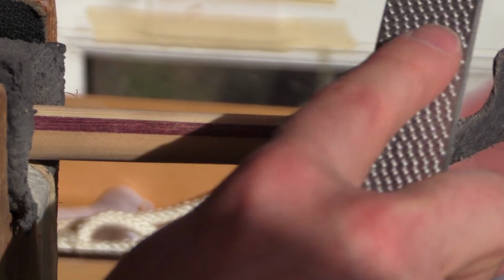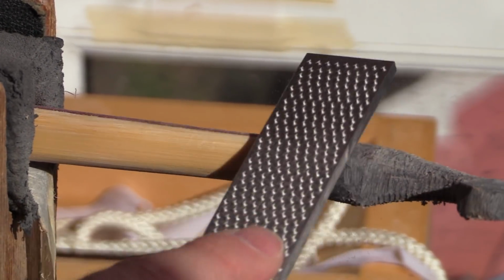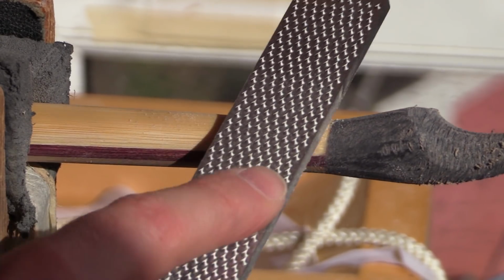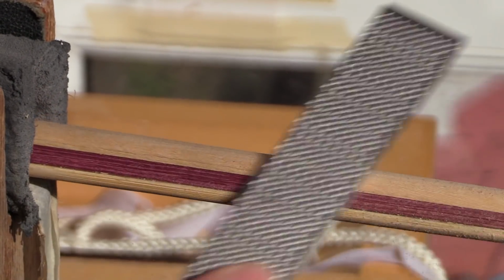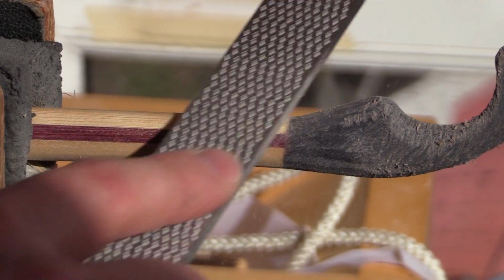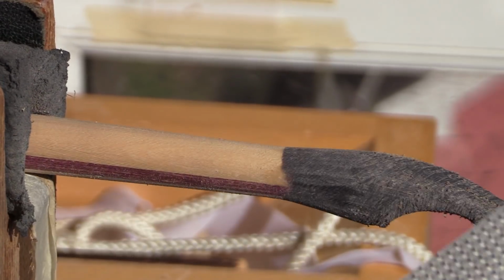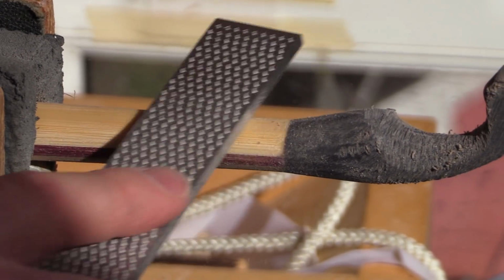And I know that a lot of people, particularly perhaps who've never had anything to do with archery or are completely new to it, do say, well, don't the nocks come off, don't they snap? Well, in all my years of making bows, quite honestly, no. If a bow breaks, it's very, very rarely the nock. And if it is a nock that's come off, I mean, we obviously get people bring bows to us, say, for repair. They're not our bows, and if a nock has come off because it just hasn't been fitted correctly, not the sheer amount of meat, not the amount of horn that's present, but the actual depth of wood that's going into the nock and the quality of that fit, getting that fit neat and correct.